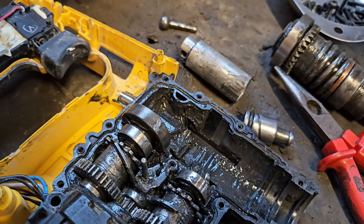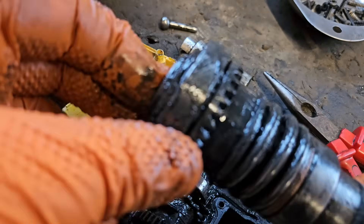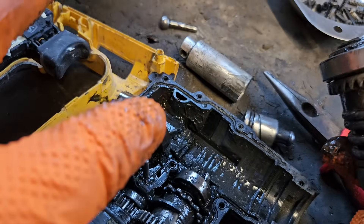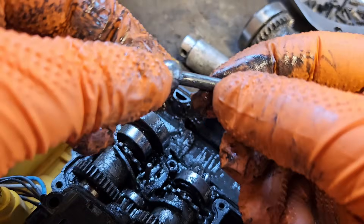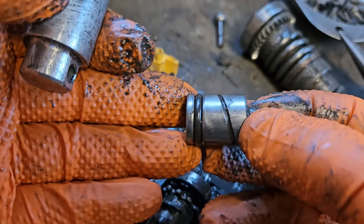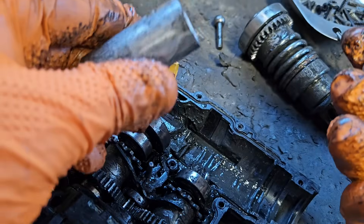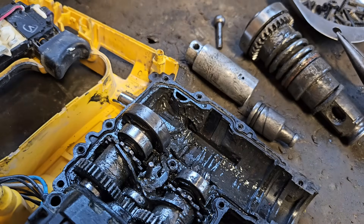This series of videos is aimed at a DIY fix. So if there's anything wrong on here - if the catch ring's gone, it might be too advanced for most people to take on. Or if there's something wrong with the cylinder itself, it's going to cost too much money. And if this is broken and you don't have an old spare one, it's going to be too much money. If the motor's gone, it's going to be too much money. So really, most of your servicing will involve replacing this little selector, this little ball spindle. You shouldn't even have to replace this striker too often. But mostly, you get away with it. If this is worn, it might be time to get a new machine, because everything else will be worn to that degree.